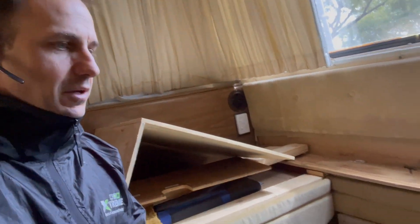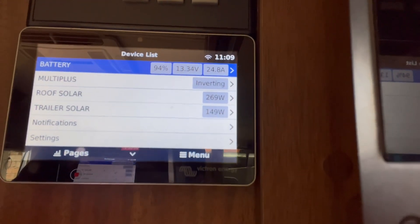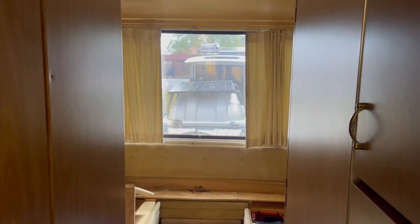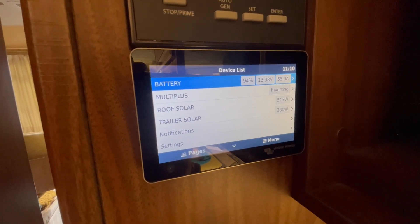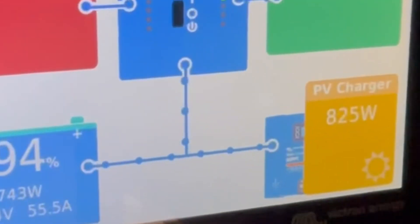840 amp hour upgrade from the 450, and we've put another 150 amp controller over there to take care of that 400 watt SunPower panel on the trailer. Because they're networked together on the Cerbo you can see them as a total. We're in overcast conditions but they're still putting in. If you want to see what each array is doing individually, we've labelled them 'roof solar' and 'trailer solar'. That's not bad - the trailer one is just sitting out there open and that 400 watt panel in overcast is giving a pretty good result. I'd be happy with that.